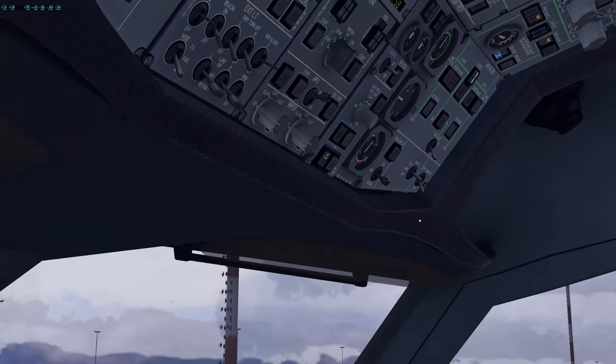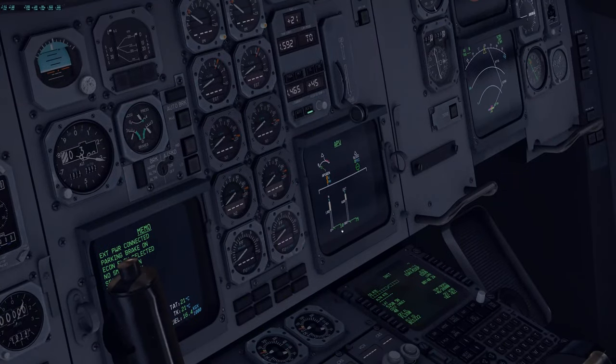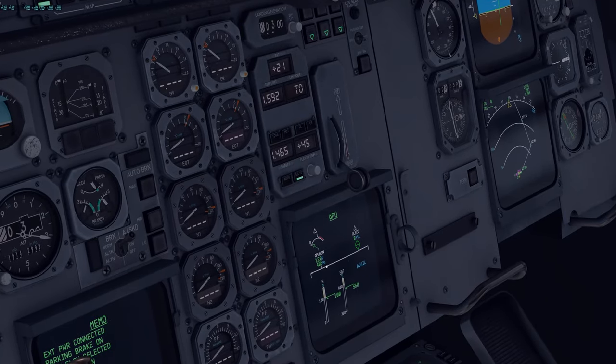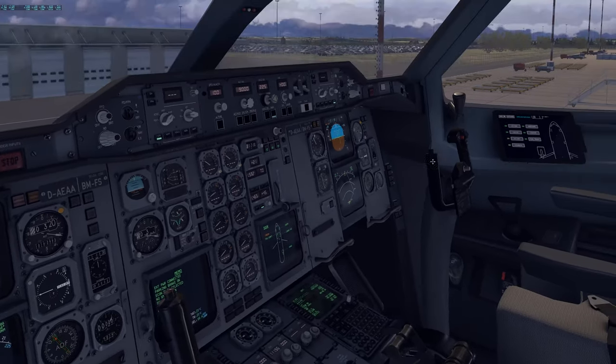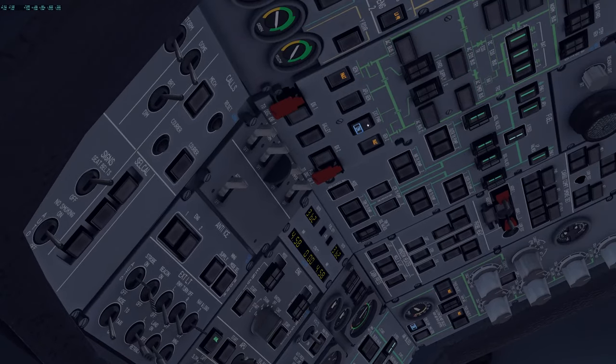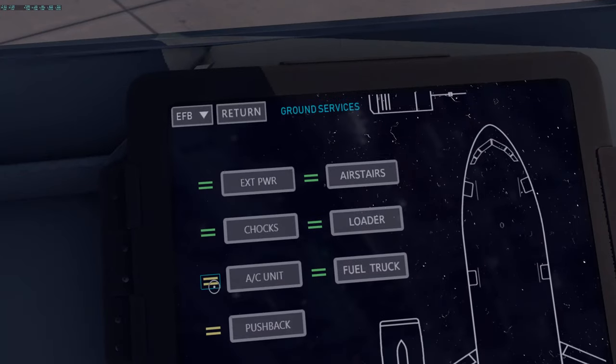Select the master switch to ON, wait about one to three seconds, then start the APU by pressing the start button. You'll see the ON light illuminate and then the ACCEL light — a blue light — should illuminate afterwards once the APU spools up. Once started, verify the voltage and frequency, see that the EGT starts to level off, and the APU system display will switch back to its automatic system. You'll see the AVAILABLE light illuminate once the APU is ready.